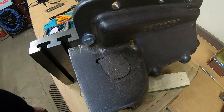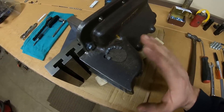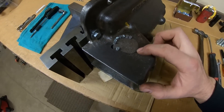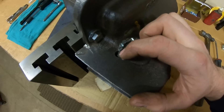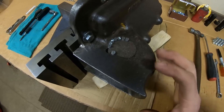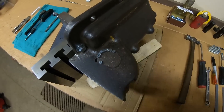And the process begins again. We're near the end of another day — I want to show you the progress. I've got eight of them stitched in so far, and I am not regretting one bit grinding this one out farther to get rid of all of that hard cast from the heat damage. So far these have just been sinking in one after another with no problems. I estimate I'm going to need about 21 of them to get around here — comparable to the 19 I put in on the other side. I left that leg long because I had to cut into that roll pin access hole that I believe was there from the factory — I'm just going to center that under the end mill and round it back out once I get the patch in and everything else ground. We're flushed out very well again. I love how well that cast matches in surface finish — once we get some paint on that, you're never going to know that was even patched.